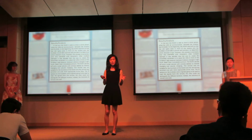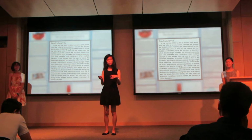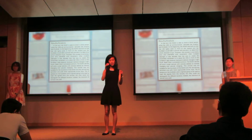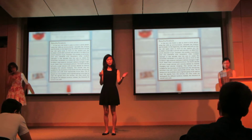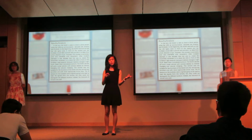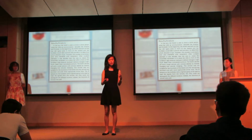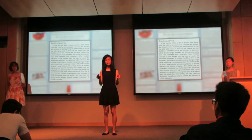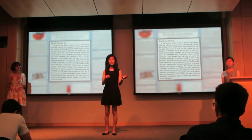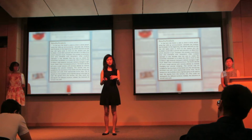So one of the main things that we had to fix is how to get the Arduino Uno to communicate with the Scribbler 2. In the beginning, we had the 3 LED lights in front of the Scribbler's camera. So basically, it would take a picture, process the image, and figure out which way to go depending on the light. However, image processing is actually a really slow process, so we had to figure out how to make it quicker. So we put the LED lights right next to the Scribbler's light sensors on the back. And basically, the Scribbler detects any changes in light, and therefore this process is much faster than image processing.